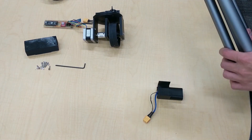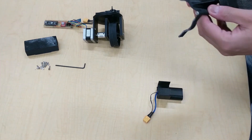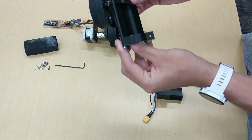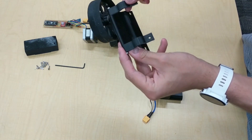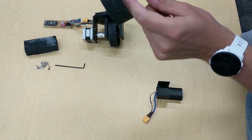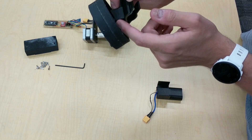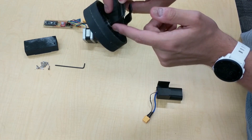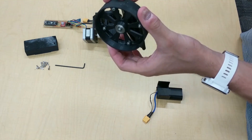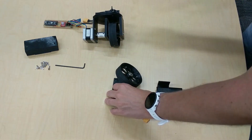I already pre-assembled the main sub-assemblies. This one is the wheel — you can see it's just this printed part. We assembled two hinges so they have this nice clamping mechanism, and then I just hammer a shaft. There's a little spacer between the end stop and the bearing. The wheel itself is also pre-assembled — it's actually two halves that were printed, and then it forms a wheel. So now it spins pretty nicely and we have two of them.